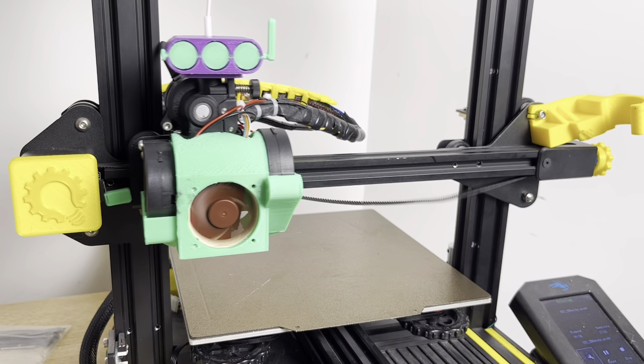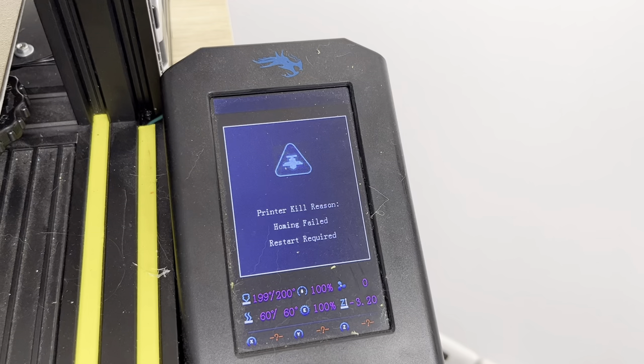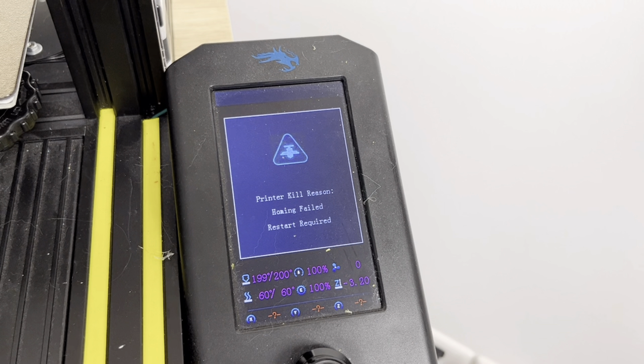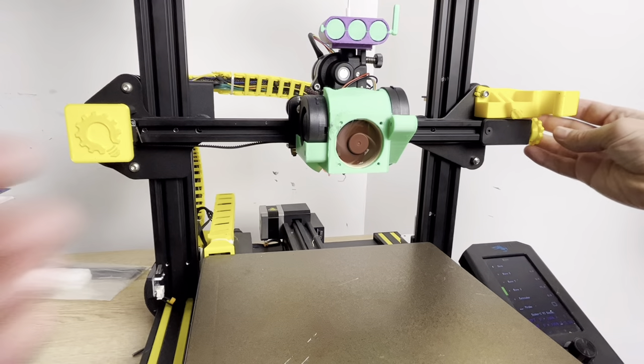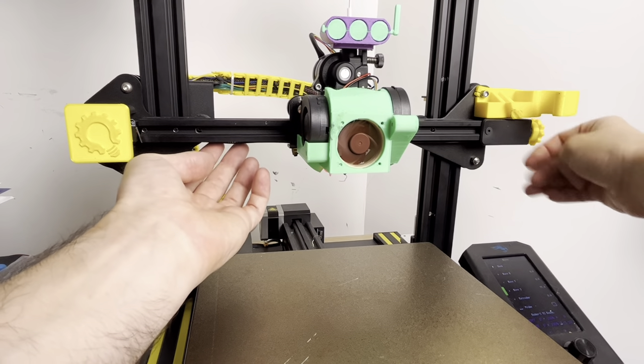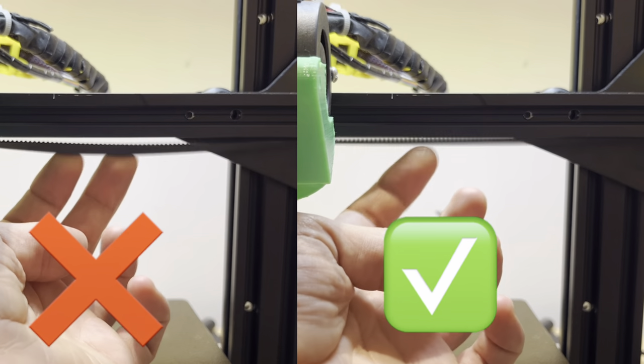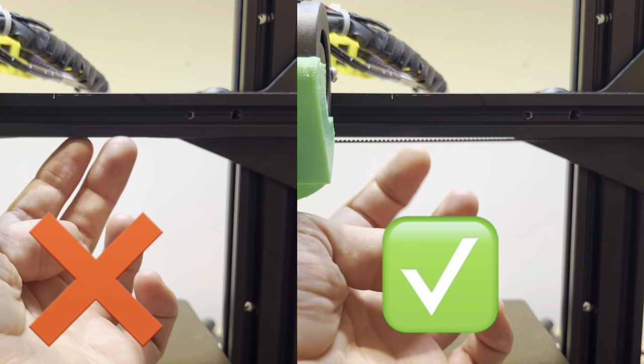It's almost there — and it looks like it failed. It died. We have the printer warning screen here telling me to stop being an idiot. Kindly noted. Now that we're done with that first stunt, we're going to use the knob on the side and tighten up the X belt. You don't want it so loose that it's sagging, but you also don't want to over-tighten it either.